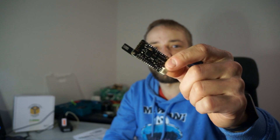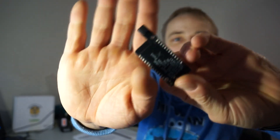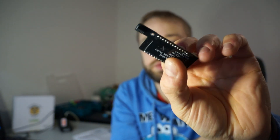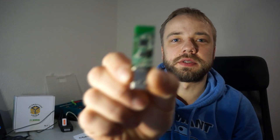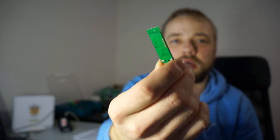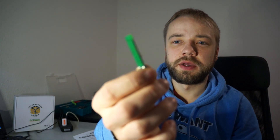Today I want to finally release my ESP32 software to flash the CC 8051 core family from Texas Instruments. I made a small PCB for it, so it's quite simple to connect to the default standard 10-pin 1.27 millimeter connector, which is used in for example these small USB dongles from Texas Instruments available for Bluetooth and also for Zigbee.